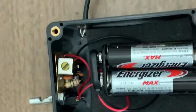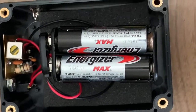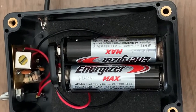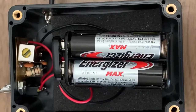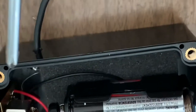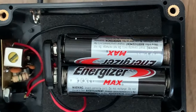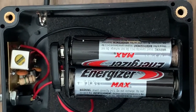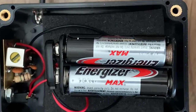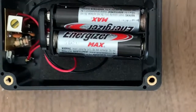And that's very simple. Very simple circuit. One transistor. A few capacitors. An IF transformer — I went ahead and used the yellow from a 455KC system. Be careful: you do want to use a coupling capacitor from the output; you don't want to connect it directly. I made a mistake of doing a probe to an oscilloscope with another one, and it looked like it had destroyed one of the windings inside the IF transformer. So make sure you couple it with that capacitor. Very simple circuit. Very stable. You heard it.